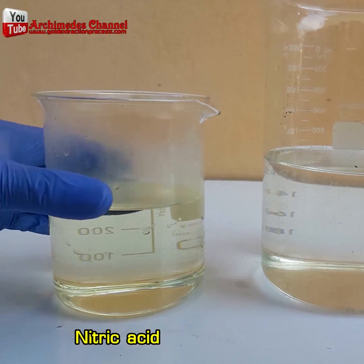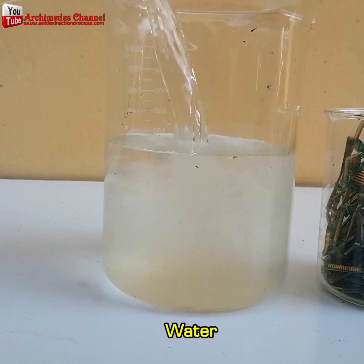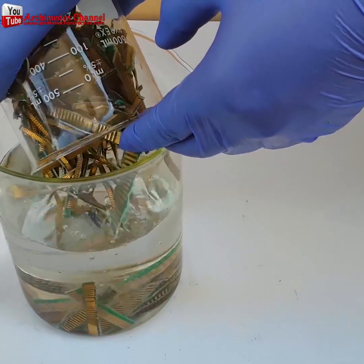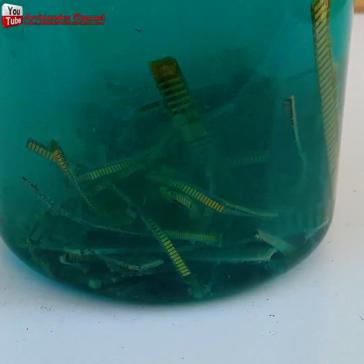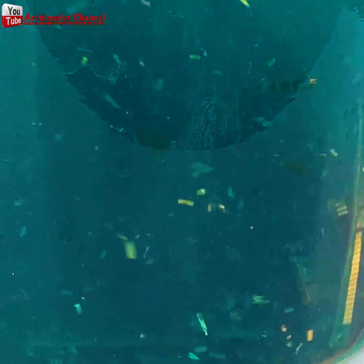Pile it up. To separate the gold from the PCB or gold fingers, use a 68% nitric acid solution mixed one-to-two with water. Let it soak, occasionally stirring it around — you can see it dissolving there, disappearing in an amazing green mist and starting to break the whole thing down.